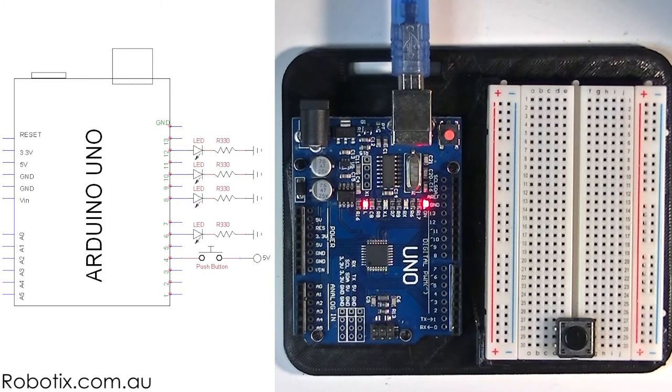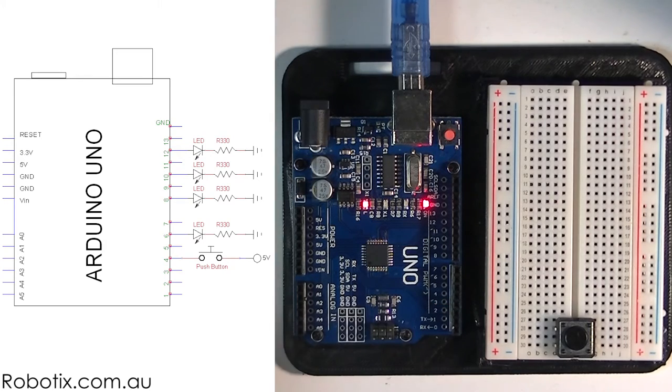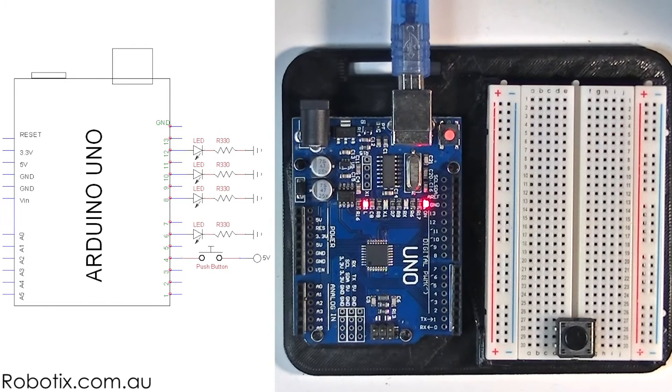The way that the Arduino is going to read it is through one of these pins. We're going to designate it as an input. And if it reads a voltage that's above a certain threshold, I think it's about above 3 volts, then the button is going to be high. And we can write an if function, and then we can roll out some LED patterns.